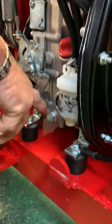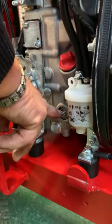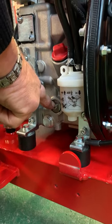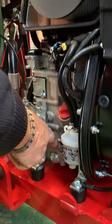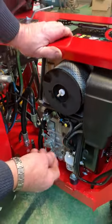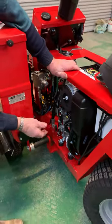That's the drain bolt for changing the oil down there, and that's the little allen key above it. That there is an oil magnet — it needs to be cleaned every two years. You take it out, twist it back a small little bit, then pull it out, wash it, and replace it back in again. It's all quite easy to get out there when you're at that.